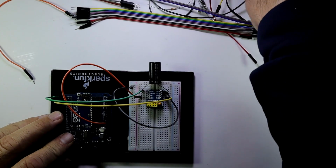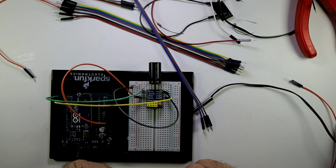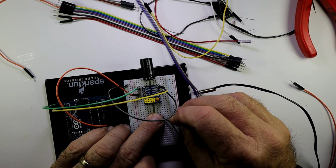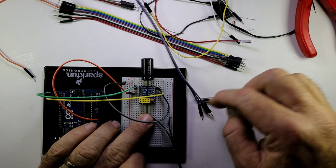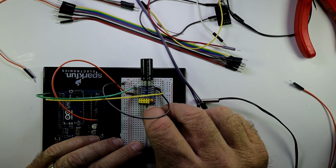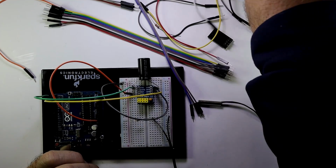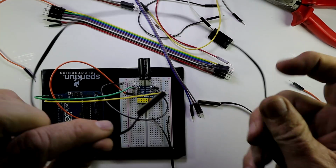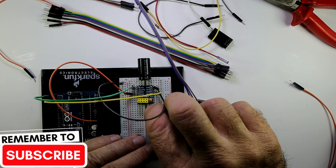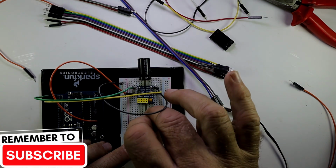And our next thing is our two sensors, our 10K thermistor. So let's start with that. We're going to connect the 10K thermistor between VCC and our, let's make this our VCC rail here, our 5 volt VCC rail, and our 10K resistor, and just put them together there, and we go to ground with that pin. Then the next one as well, another thermistor, also to VCC, and let's put it there. And then we take our other 10K resistor and we just go to ground from there.